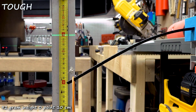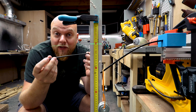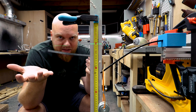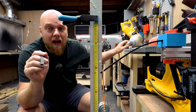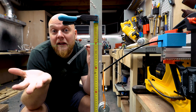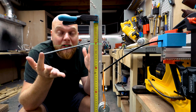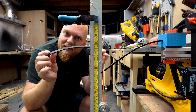A little side note: I have flattened these long pieces because they were so heavily, severely warped that the testing would be pointless. I heated them up with a hairdryer, put some weight on them, and now they are nice and flat. Great little tip — if you have warped prints and want to get them back to flat, take a hairdryer and put some weight on it. Now let's continue with the testing.